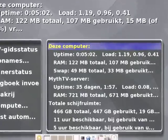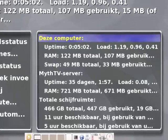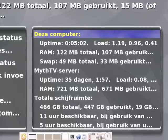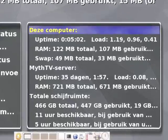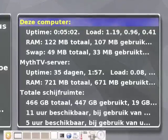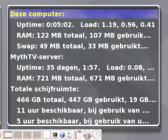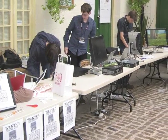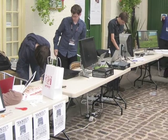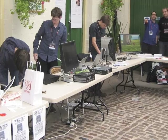It's powerful enough to decode video. 720p video you can decode on it, and that's on the ARM side. With the DSP you could offload that, so you could do high def as well. There are some problems with full high def with the video output, but in theory you could get there. It's pretty small, so you could just build a box and hook it up to your TV. Yeah, stick it in the back and you don't even see it.